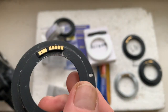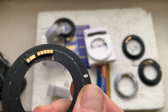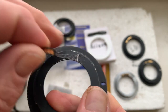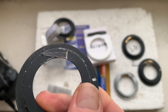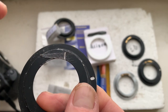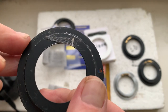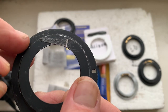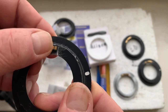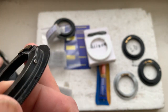The camera will show the aperture. Then mark the borders of the chip, remove the chip, remove the double-sided adhesive tape, remove the black paint, and apply a little super glue. After degreasing all surfaces, apply a little super glue and install the chip. Then install the adapter with the chip into the camera.